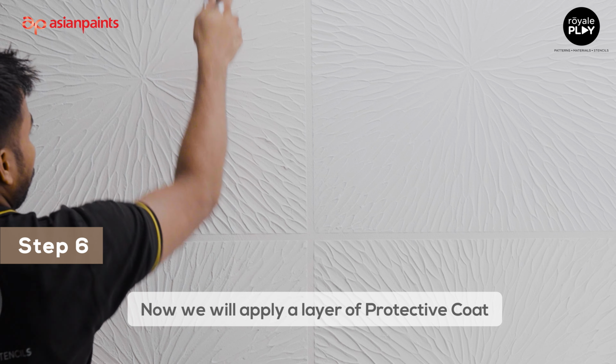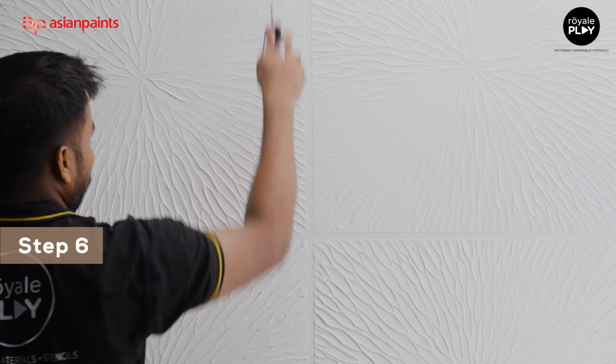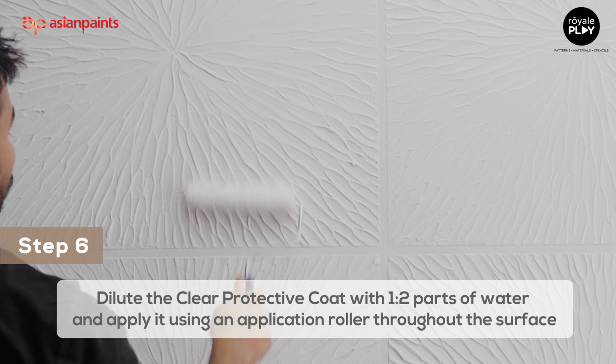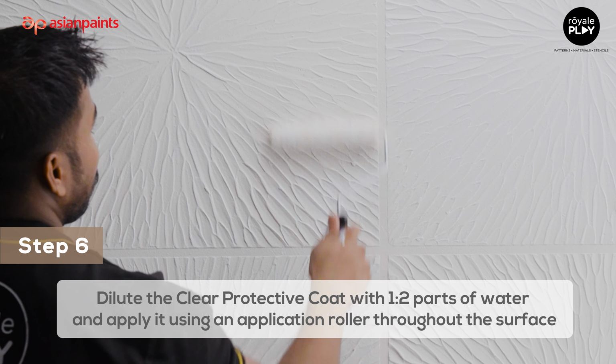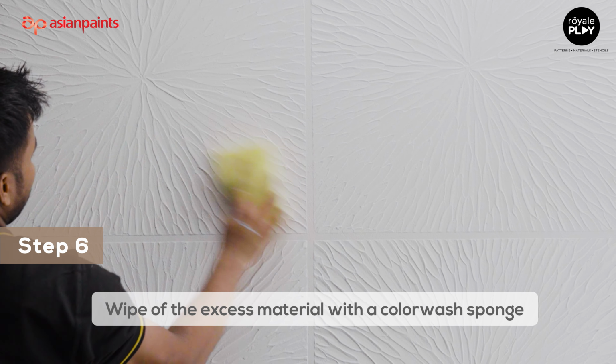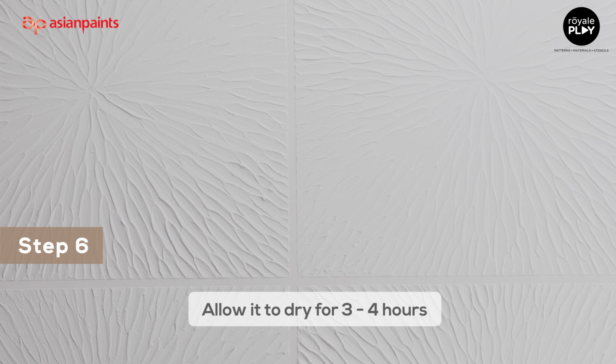Now we will apply a layer of protective coat. Dilute the clear protective coat with 1:2 parts of water and apply it using an application roller throughout the surface. Wipe off the excess material with a color wash sponge. Allow it to dry for 3 to 4 hours.